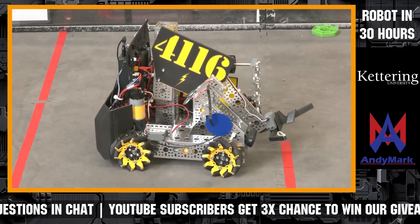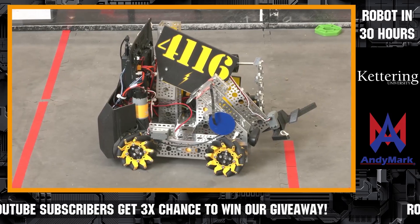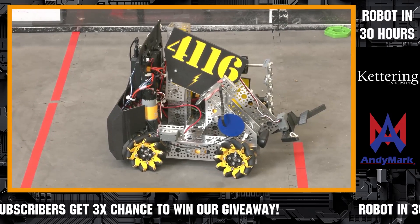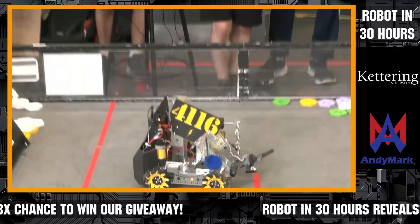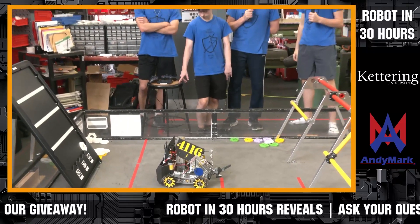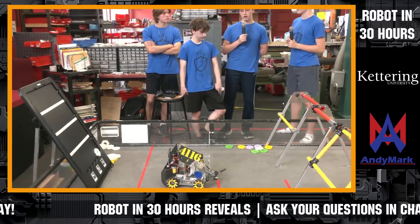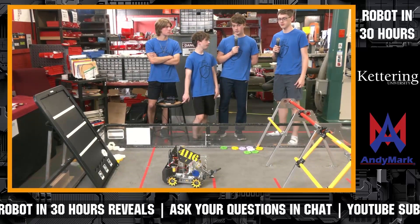One of our original ideas for launching the plane was to have four wheels moving in sync, so that way we could launch it with the rotation of the wheels. However, the problem with that is there was way too much friction — even putting 70 amps into a 6,000 RPM motor hardly ever got it to turn. So we switched that.